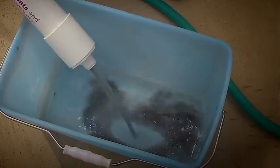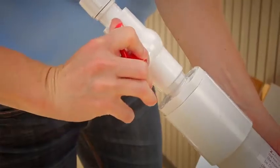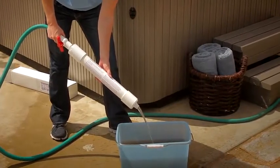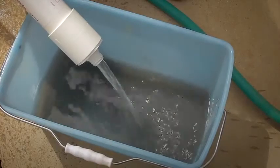Turn on your water source and begin to flush water through the clean screen while holding it outside of the spa. Adjust the flow valve to begin a slow flow and continue flushing water through it until it runs clear. If it's clear to begin with, simply flush the water through slowly for one minute.